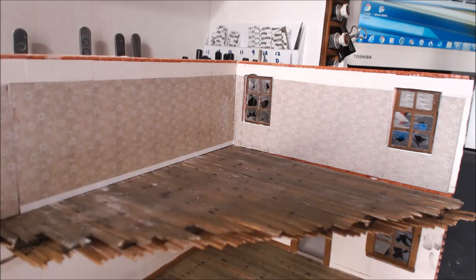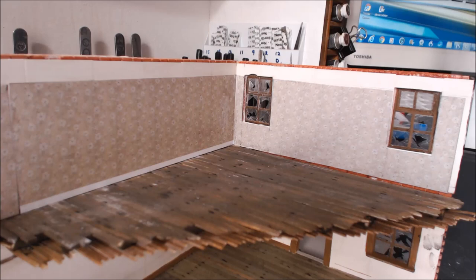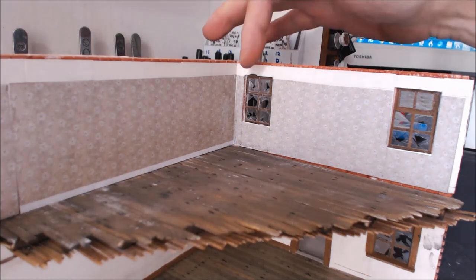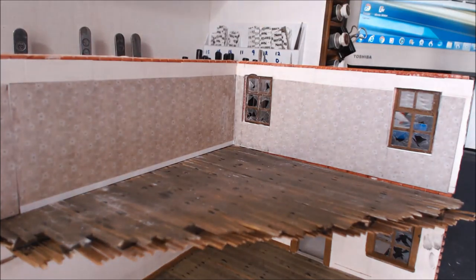PVA with a little bit of water works and does the job. The first piece I put on with PVA straight to the wall got loads of bubbles, but they pulled themselves out fine. The second piece I put PVA on the wall and also on the back of the paper, let it soak just for a few seconds, then applied it - no bubbles at all. Doing PVA on both the wall and back of the paper makes life a little bit easier.